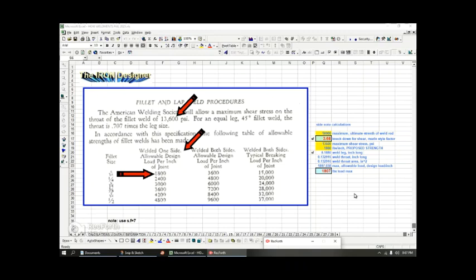Okay, so just keep that as a mental note that for every inch of weld on one side in bending and shear, it's always combined loading. You cannot assume only one mode of failure. It's not just only shear. It's not just only bending. It's not just only torsion. It's combinations of things. If you have combinations, then these loads have to be divided among all the different combined variations of your load, okay? So just keep this value in the back of your mind.